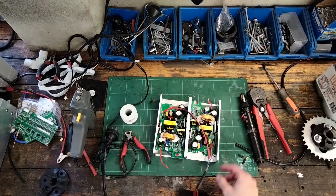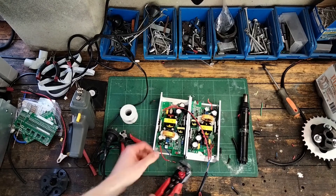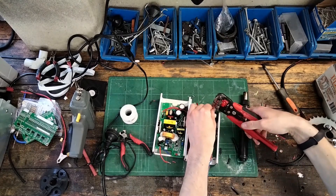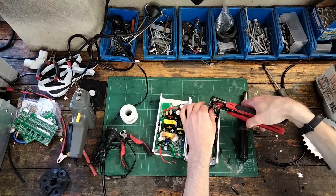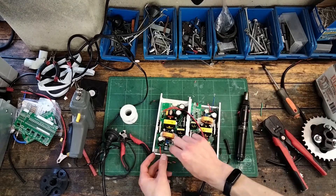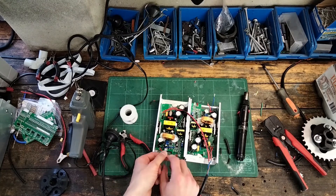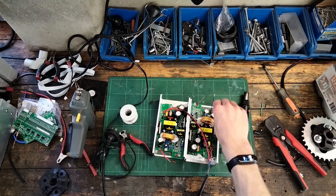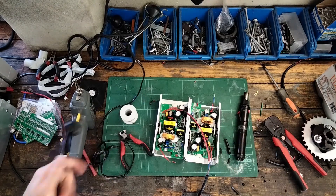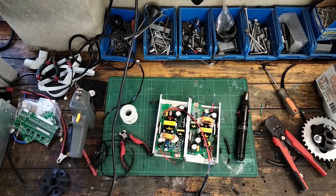The power supplies are linked together on the AC side. I'm going to strip these wires and match the voltages up. I'm aiming for about 41 volts because that's enough to charge the battery to about 90 percent — all I need for a fast charger I can use on the side of the road. It doesn't need to charge all the way to 42 volts, and the last 10–20 percent is slower anyway because the voltage stays constant and the current drops off. I'll plug each power supply in and adjust the voltages until they're well matched.